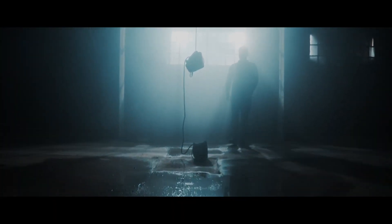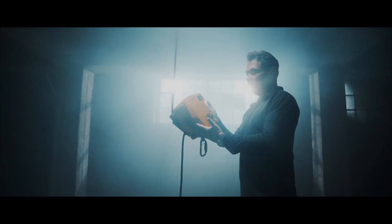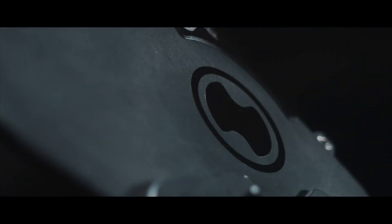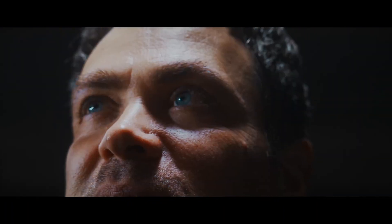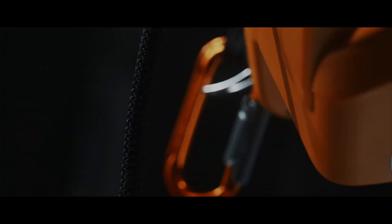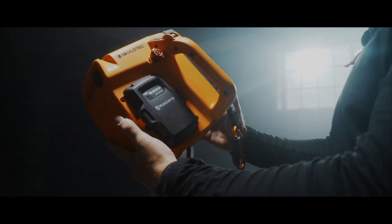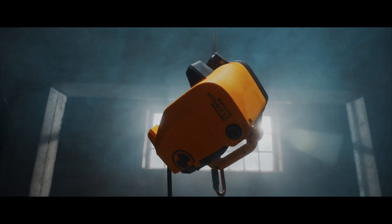First one, quite a noticeable one — it's rated for one person. So the machinery directive gets updated and there are some EN norms within that we use for testing the relevant parts. It's harmonised from a few different standards, and under the machinery directive this has been certified as one person. You can have rescue procedures with this because we still have a remote control — we can still rig at the bottom or rig from the top and lower remotely. But we won't do a two-person pickoff. If that's what you wanted, then you would take the bigger and more powerful ACX.